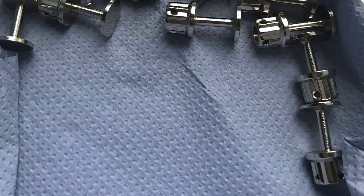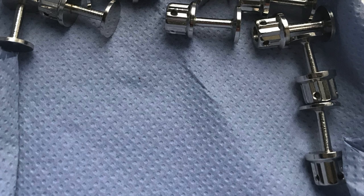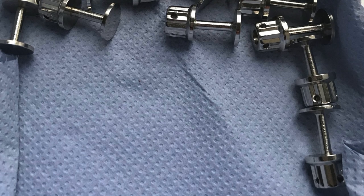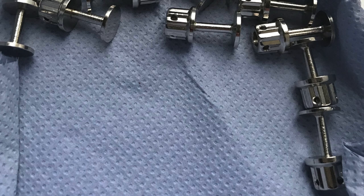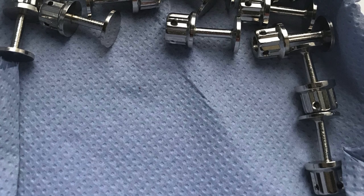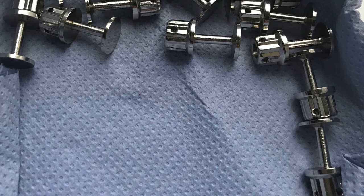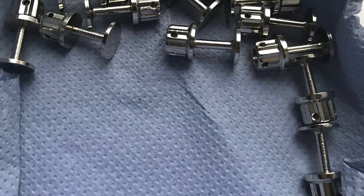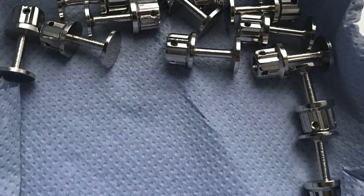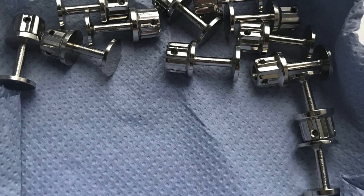After finishing them, we have an XRF machine at Spa Plating in Bath, so we put them under the X-ray machine to see if my calculations are okay. We measured between the lowest — about seven and a half to eight microns — to the most on the corners, where it's quite normal to measure about 15 microns. So the average is 10 to 11 microns, which is absolutely perfect. The customer asked for a minimum of five or six microns and I went a little bit higher.